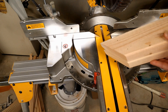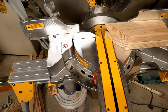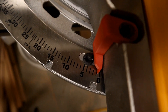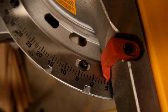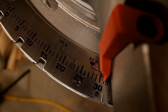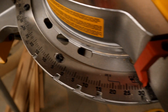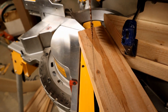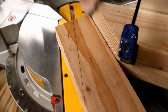You want to get your two-by-four — or a couple of them like I did — and cut it at a 45-degree angle. Put it up against your fence close to the cut line with your miter saw at zero. With your 45-degree angled cut two-by-fours in place, we are at zero — and zero now becomes 45 degrees. We want 75.9, so we need to go 30.9 degrees on the saw. Let's go over to 25, 30, and get just before 31. Lock it in place. So with the saw set at 30.9 — which is actually 75.9, because zero is now 45 — I've got the two-by-fours clamped down at the 45-degree angle and the saw runs right along the line. And that's how easy it is to get those steep mitered cuts.